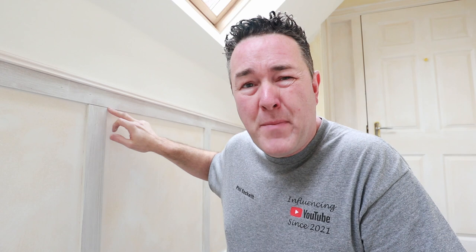Here we are — another day, like a microwave video. You've just seen me one day and now I'm back the next. What I was going to do yesterday that I couldn't because everything was drying: I want to get these joints filled. The joints that are a bit bigger — I don't want fine surface filler in those — I've got some two-pack wood filler. It doesn't matter what brand you use; this is the Ronseal. Mix a little bit with the two-pack hardener — that stuff you never get the quantities right and it dries too quick.